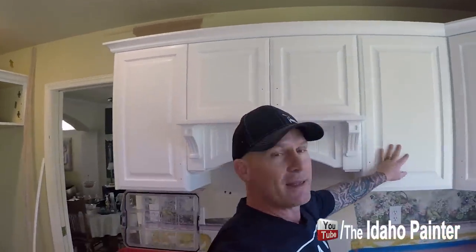I'm going to give you a 360-degree view of this area. These were golden oak cabinets — just a standard oak. When we got here, we set up the booth, took the cabinets apart, did our numbering system on all the cabinet doors, masked off the boxes. We used a primer surfacer to do two coats of primer surfacer. We did aqua coat, which is a grain filler to help fill the grain. If we don't do any grain filling, these cabinets would be really grainy, and being painted white, they wouldn't look very good. So we did the grain filler and then two top coats. Journeyman John was the one spraying these, and we were teaching Captain Zach how to spray.